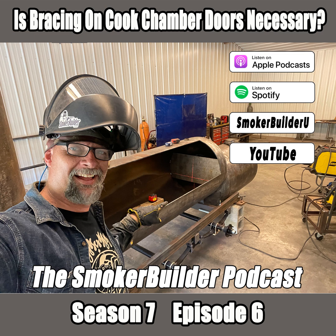One more thing about Greg's question: whenever I have to reinforce my doors or pull them back into submission, my favorite thing is just a piece of quarter inch or three eighths round bar. I pull the door where it needs to be and tack that on both ends. Guys like Mike Garza have done some fancy stuff with turnbuckles — a left and right-hand thread that you tighten down to pull your door where you want it, then jam nut it or put a different brace in and cut the turnbuckle out. Both are great ways to do that. I should probably spring something on camera one day and fix it, but doing it my way I never have anything spring.